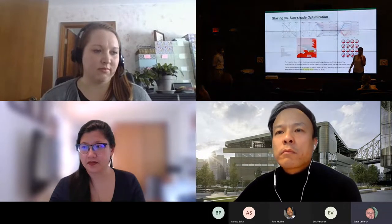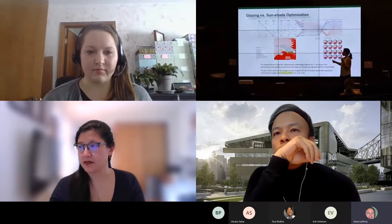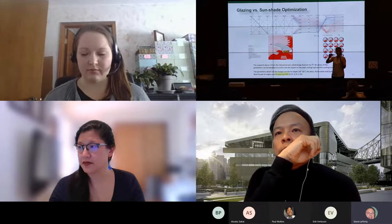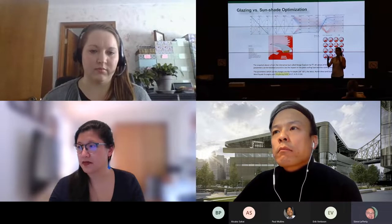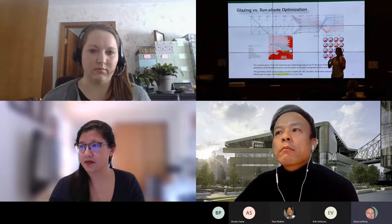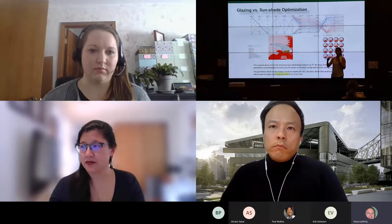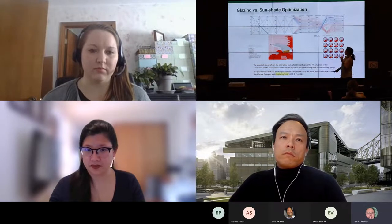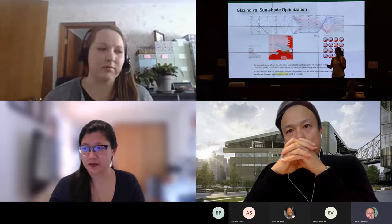These are snippets from the glazing study that the mechanical engineer did. So what they did was they were able to help us create a calculator where you can push and pull different categories. And so that way we can test the performance, what will give us the biggest bang for our buck. Is it the performance of the glazing? So that is, trying to find the best solar heat gain coefficient. Right there, you might want to remember that. As well as the depth and spacing of those vertical sunshades.